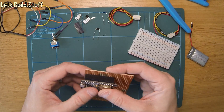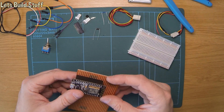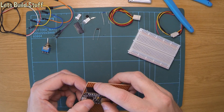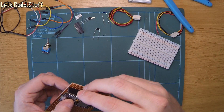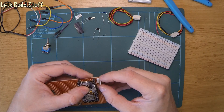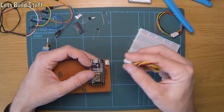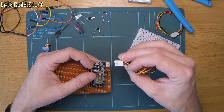This is going to be powered off a battery so I won't actually need a regulator on here - I can just go straight for powering the ESP just from the battery with one of these little headers. I'll probably end up putting that in there like that - we've got the three pins so you've got the supply, the ground, and a reset which I could also use if I need to reset it at any time without having to turn the power off and on.